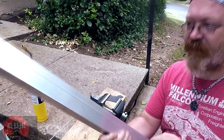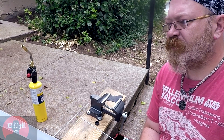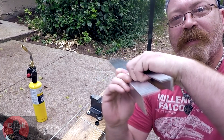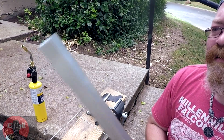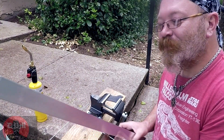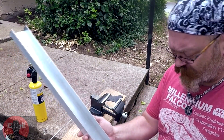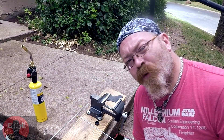I do plan to throw another bead on the outside as well. I've got a good quarter, almost half an inch worth of separation here at the end and it's not giving. So it looks like this might actually work. I'm going to throw it back in the vise, make sure it's level this time, and go ahead and finish laying this line, then let it completely cool off and see what we're dealing with.